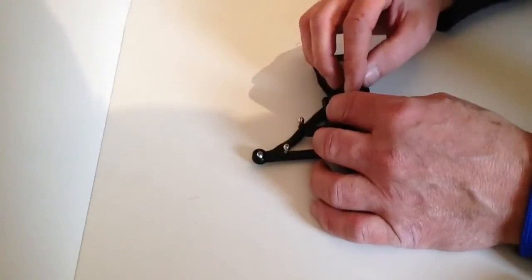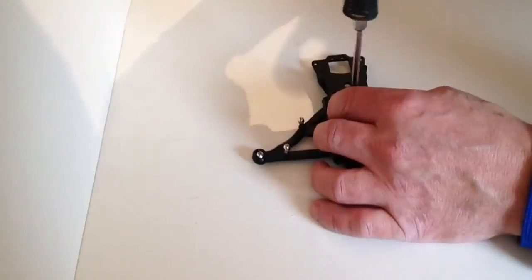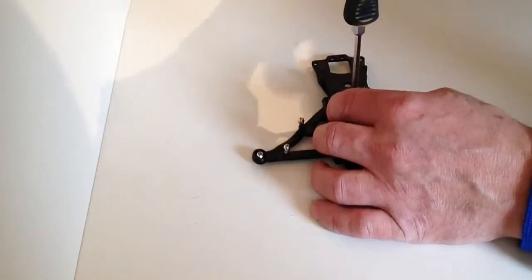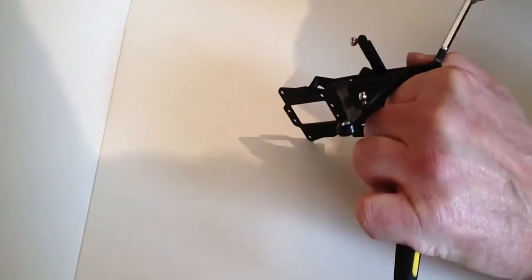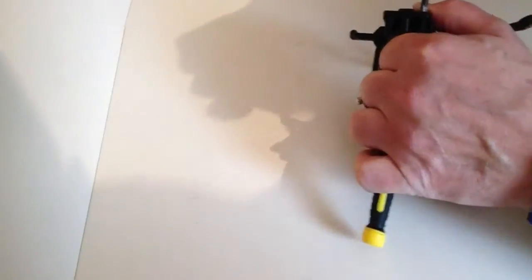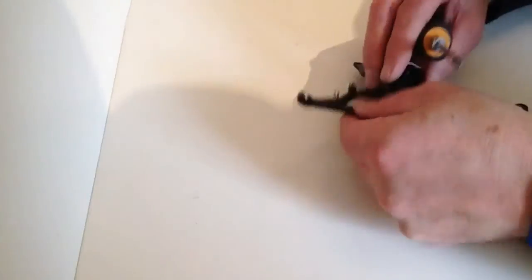take the remaining screw section, pop that down into position, and once again nip that one up. Now a little tip that I use, it's two screwdrivers, put one in the bottom, one in the top, and what that will do is that will actually tighten that up without that spinning. Do that once again, like so. So what you're doing is you're placing one in the bottom head here, one in the top, turning clockwise.